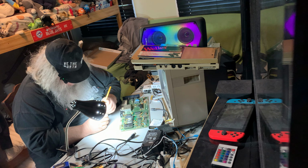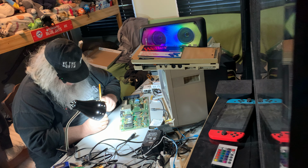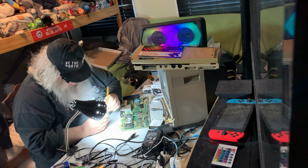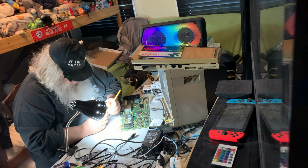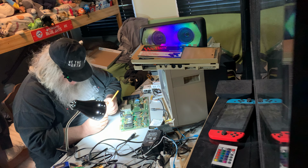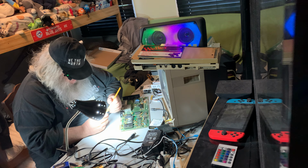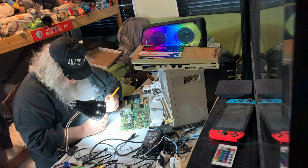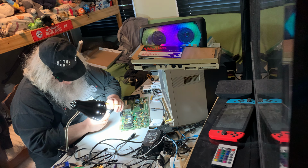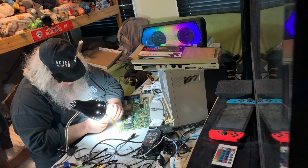So be firm but gentle, gentle but firm, and just give them a little once over. Try not to bend any, and it's not a bad thing to go down the inside as well as the outside. And I'm just going down the whole length of them in one sort of swoopy thing that doesn't put too much pressure on any pin. And yes, indeed, little bits of eraser will come flying off. And as I look at this, oh yeah, I bent some pins. But remember, this chip is not working.